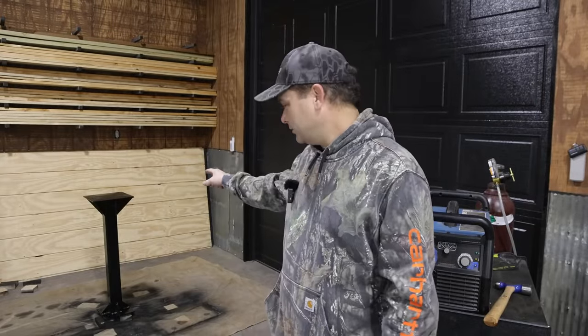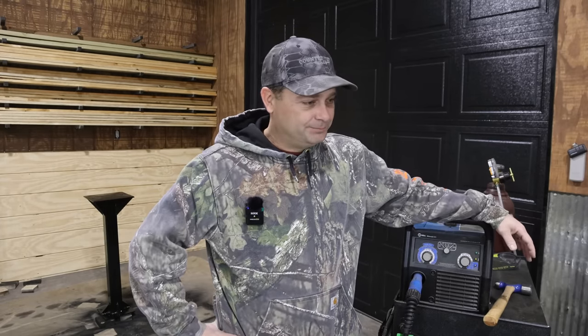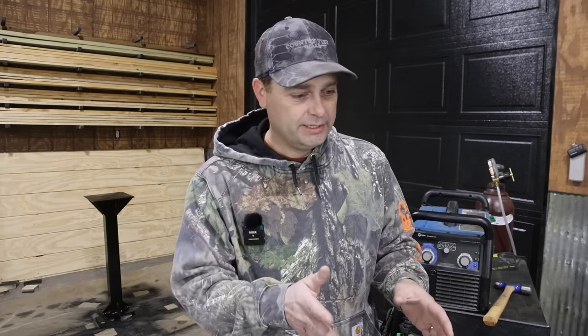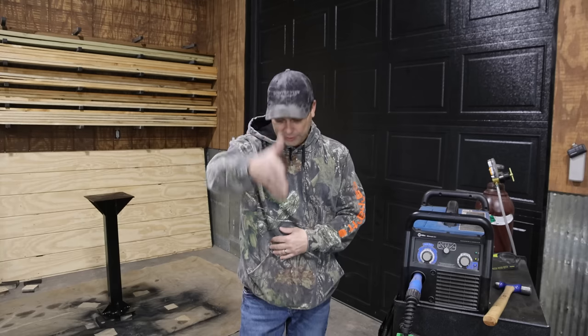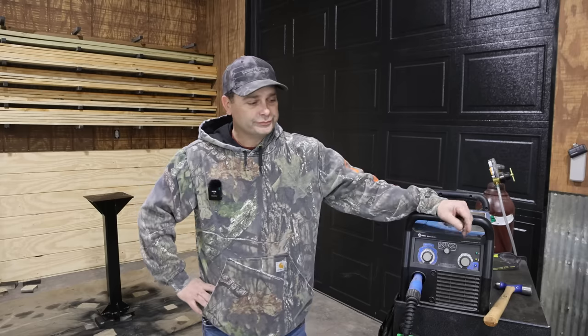So yesterday, before I started filming, I was trying to get everything ready. So I cut out the square pieces of plate. I've got this 12-inch wide plate that's like 10 feet long, way too heavy to pick up. So I was cutting it out on the ground, using a 7-inch grinder with 7-inch cutting wheels, and I cut out two pieces. Then I took the smaller piece and put it on the welding table to get it down to a 9-inch square, and now I'm at a higher elevation. Not really paying attention, just trying to get everything ready, and I start throwing all the sparks back at me. All the sparks are coming back from this cutting wheel, and they're hitting me right above my right pocket, right around my waistline.